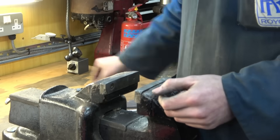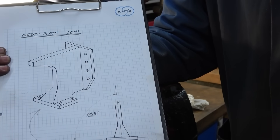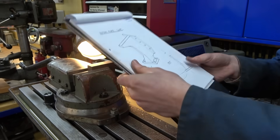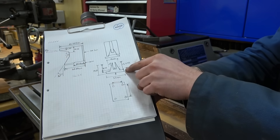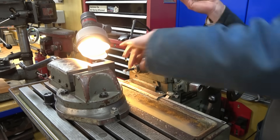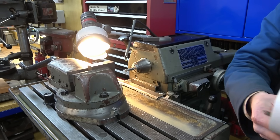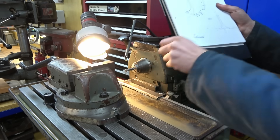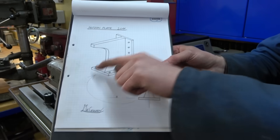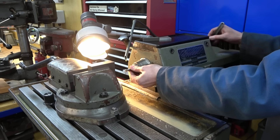I'm going to put this to one side and turn my attention to the elephant's foot feature. I'm going to return to the milling machine and mill a profile that looks like this into this block — from above you'll see that profile milled all the way up and down. To do that I've swivelled the vice through 90 degrees, got the flood coolant running, and swapped to a carbide cutter that has a nose radius on the corner so the finished article will have a nice fillet radius in that join.